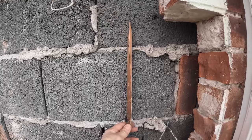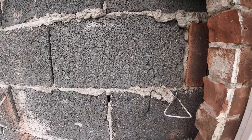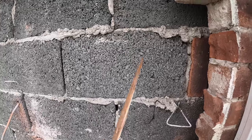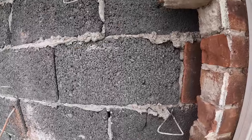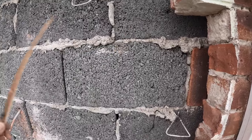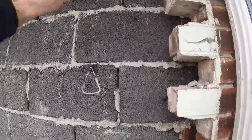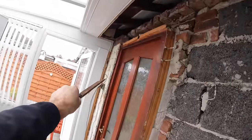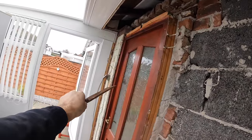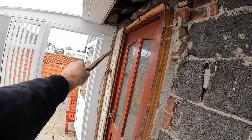So that's going to be the pillar that's going to be cut down as well, which again we can do with the steel saw because we've got the water suppression on it now, and we're not opening up yet, so we can cut that in from the back, from this side, drop that down. That'll be our seating for our steel pad stone on the top, steeling across onto that existing pillar, which is staying in. Both skins will be staying in there, I think. There's no point taking that outside skin on that side.